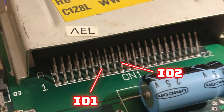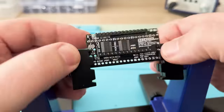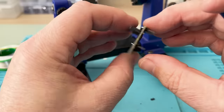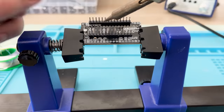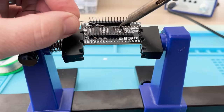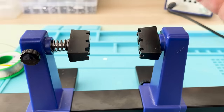There's some additional soldering to do if you want dual SIDs in your machine, so only do that if you're comfortable soldering wires to various pins on the CPU or expansion port. SIDKick Pico has paddle and mouse support just like the ARM SID, which is something you won't find in the cheaper Nano Swin SID. And something true audiophiles will love, there's the option to run sound output through a PCM5102A DAC, external digital to analog converter. That's a mouthful. Anyway, you can do that rather than through the normal audio outputs from the C64, giving you better sound quality. So, why choose ReSID for this project? Well, simply because of its accuracy, and I'm going to read a direct quote from the creator's GitHub page because I don't really understand how any of this is possible, but their words seem to make it sound sensible.